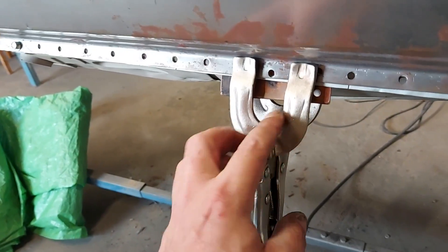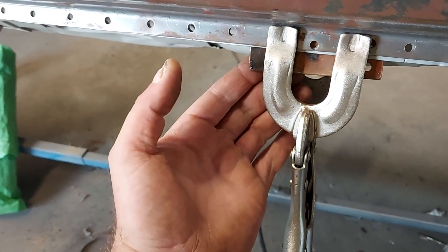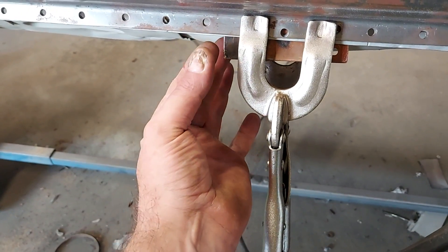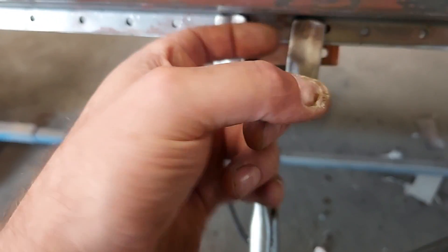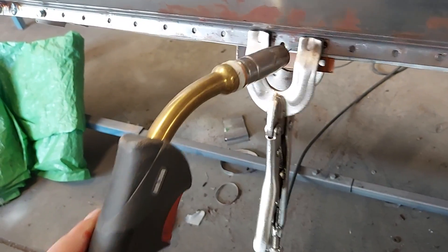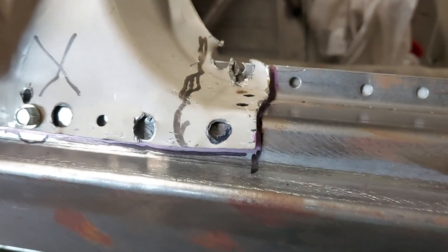Here's a clampy-clampy tool — jaws. I've got a big thick strip of copper, just loose, and I put it behind and then clamp it hard. It not only compacts the three skins together but also stops you going too far the other way, so you can confidently go with the welding torch on a high heat to create a good weld.